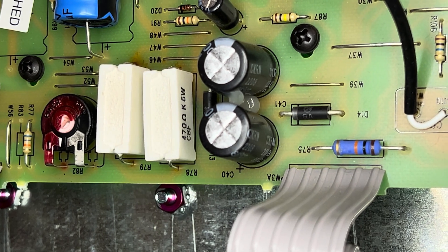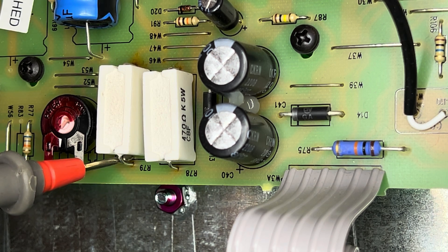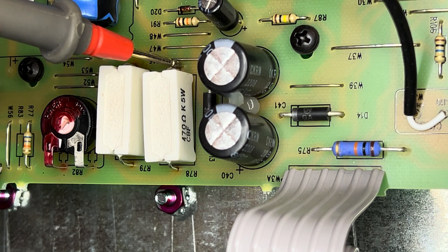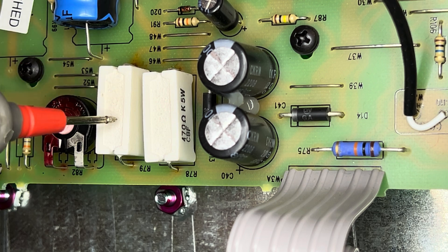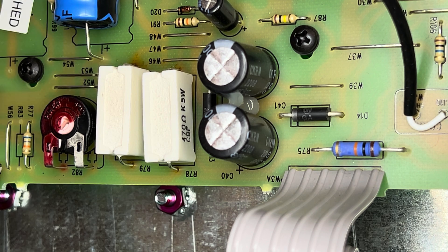This resistor right here — I'm getting the same 44 volts at the bottoms here, but on the top end I'm getting positive 16, and then here I'm getting exactly one volt. So that's a hell of a drop. This resistor has almost opened up, or become greater in resistance by a very large margin. Let's measure that thing — I bet all that noise in the reverb circuit is going to go away.